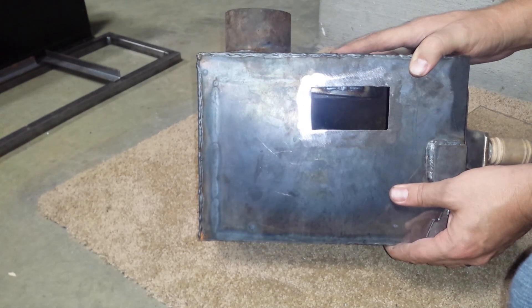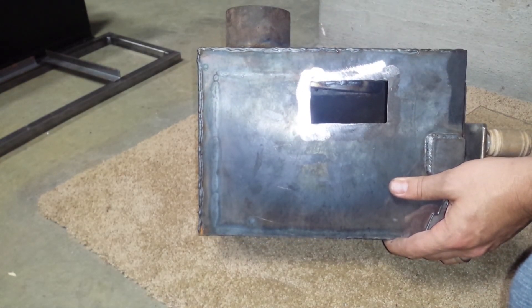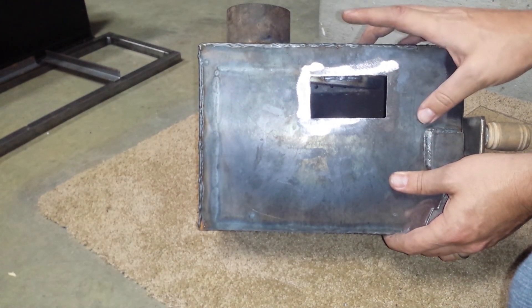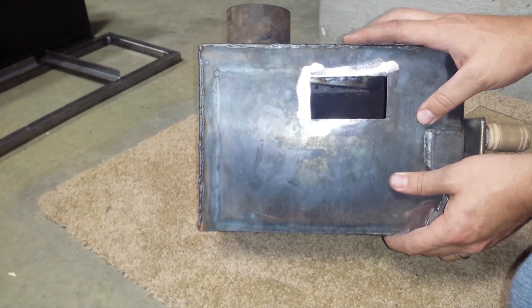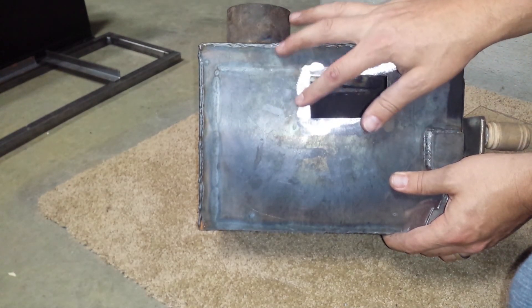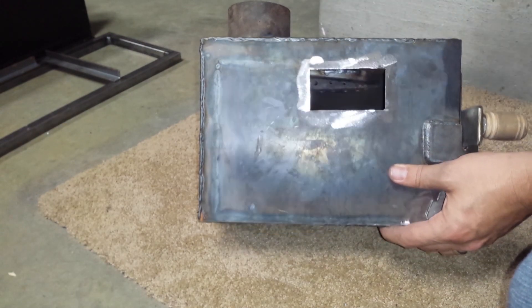You'll notice a big hole on the side of this. I'm not going to do this on the main stove, but I'm still trying to test the secondary burn. I really want a secondary burn going on in the stove so I can get more bang for your buck when you're burning wood, especially on a stove this small. I'm going to put a piece of neo-ceram glass right here.